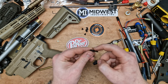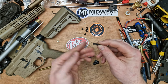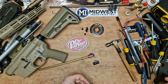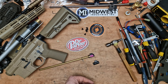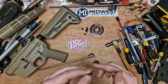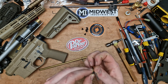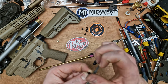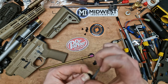There are two ways you can go about fixing this. The first way is just removing a little bit of material off that side; the second way is removing a little bit of material off the front of the arm. I would opt for the back. So I'm going to get a small file — there we go — and all I'm going to do is just slightly remove a bit of material to relieve a little bit of pressure.